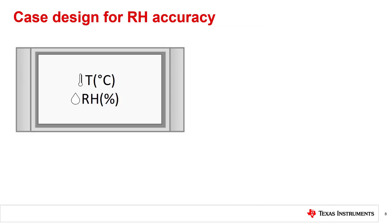A crucial part of maintaining RH accuracy in any system is the design of the case. Because of the relationship between internal and external temperature, pressure, air flow, and the mechanical structure of a case, it is very difficult to say for certain how much the case will affect your final RH system accuracy. IC humidity sensors typically have an exposed RH sensing element in polymer that is vulnerable to contamination and should be deployed with some kind of physical protection. We can make some general remarks about what every case designer for an RH system should consider. For that purpose, we'll take a look at a generic thermostat case design.